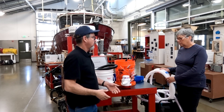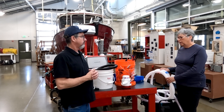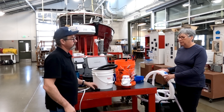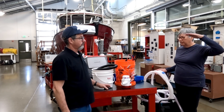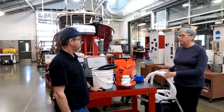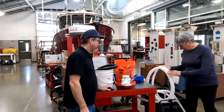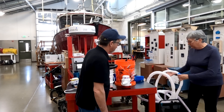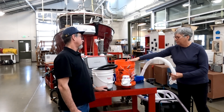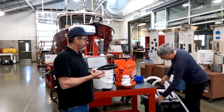This pump is going to get that boat dewatered or give you time to find where the water ingress is. That's why the specification is 3,000 gallons per hour — because in the real world you're lifting it 8 to 10 feet on a 45-foot boat, losing some there, and the voltage actually getting to the pump won't match the spec. There is also a trade-off with hose diameter: a bigger hose gives more flow, but if you're trying to stow it, consider that in the diameter you choose.